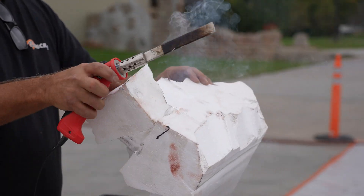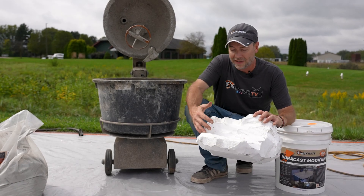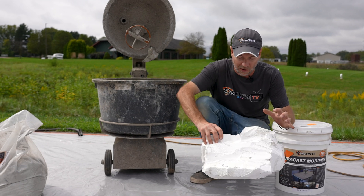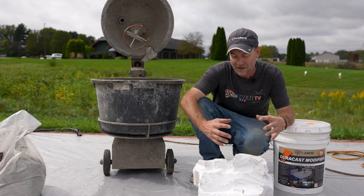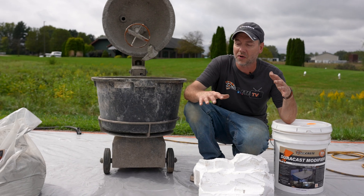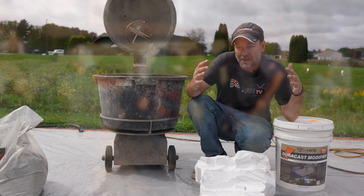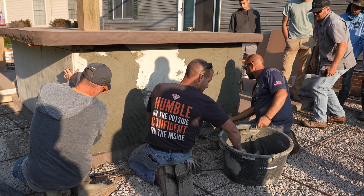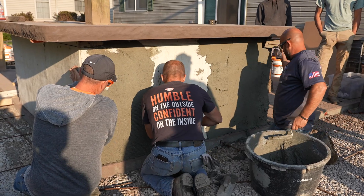All we're going to do is mix this stuff up and apply it to our foam about a half inch thick. In this case, this is going to be a faux rock that's going to sit on the ground — something that could be a hide-a-key rock or could cover up a well cover. There are so many great uses for that, and this also works great on seat walls. You could also do this on a cement board substrate like on a bar back — that's going to give it all the structure it needs as well.